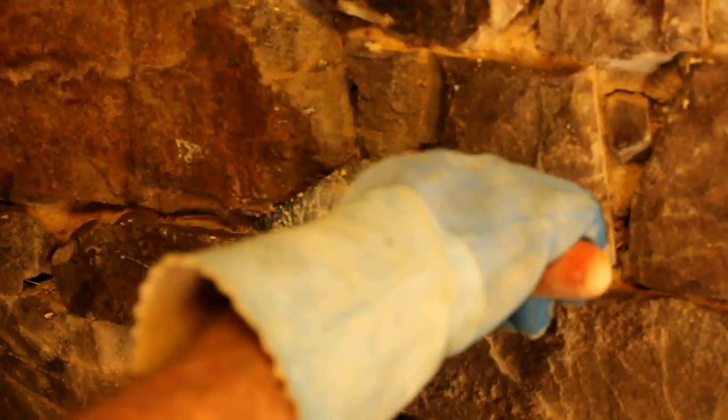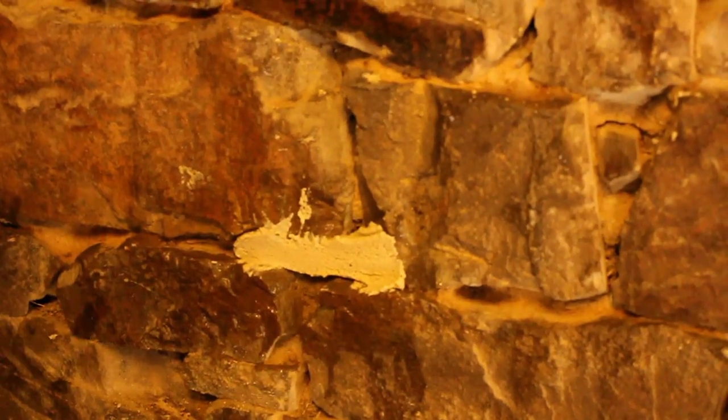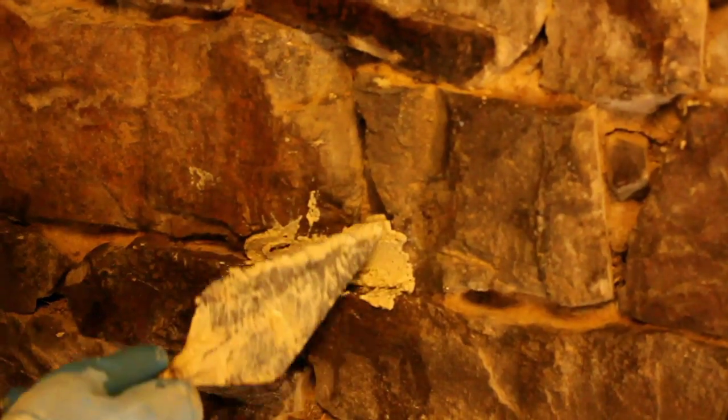I'm going to do a joint like this — it's quite deep. That's the thickness I want to go to, about a centimetre. So I make my piece of mortar about a centimetre thick, then work out which way I'm going to put the mortar in. I want to put it on this edge, so I'm just going to cut a piece of mortar, scrape it up the trowel, and then it can go into the joint — quite deeply. No problem at all.